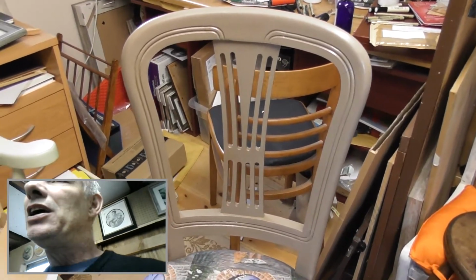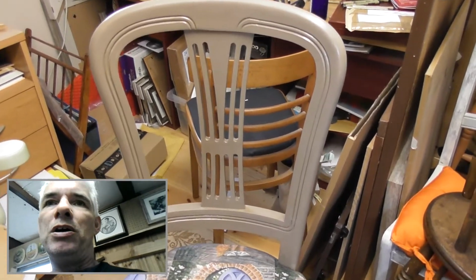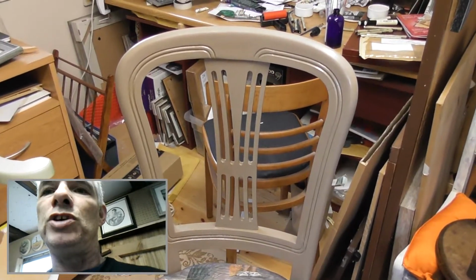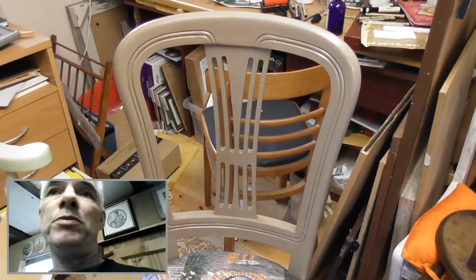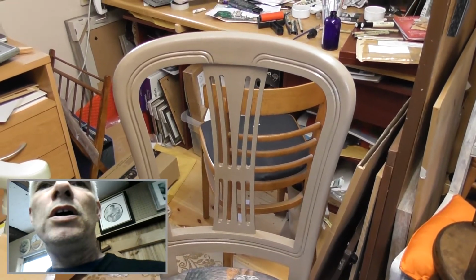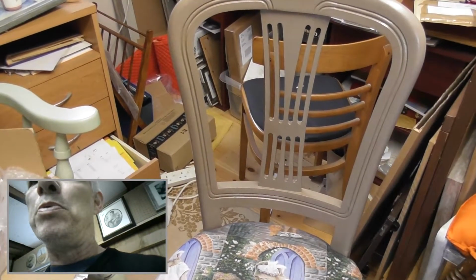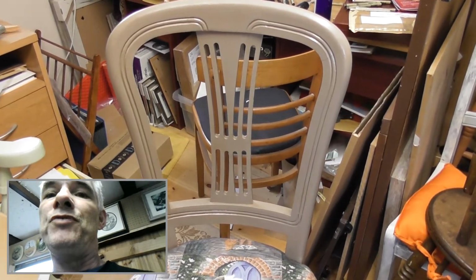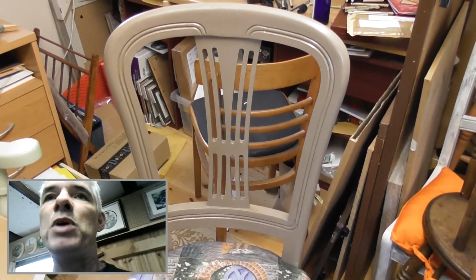There is staining. The staining doesn't really matter. It's okay, but it's annoying to me. I know it's there. I don't want it to be there. I want my customers to get the very best I can give them. So what I'm going to have to do is give that a light rub down. This is a way of putting it right if you go this far. I give it a light rub down, go over with a primer, and go back over with the whole process again. Obviously it's doubling my labour, very annoying, very time consuming, but that's a way of putting it right.